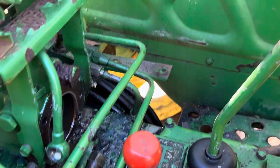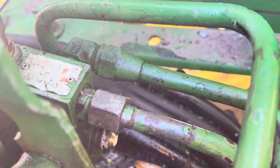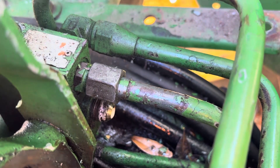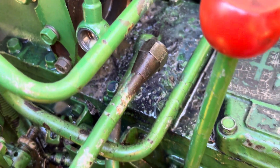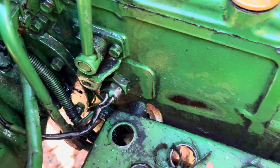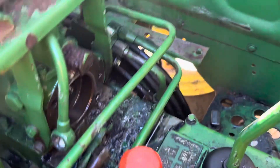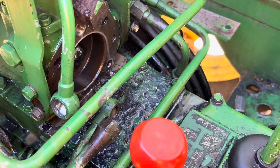Most of the lines I was able just to break free. There were these two on that side control valve — I just had to turn the top one to be able to get the wrench in for the bottom one. That one I had to take completely off. There is one with the banjo fitting that goes down and up to the front pump. I unclamped that, and this model has a hydraulic filter which was in the way, so I took the filter off and was able to gain enough access to get the pump out.